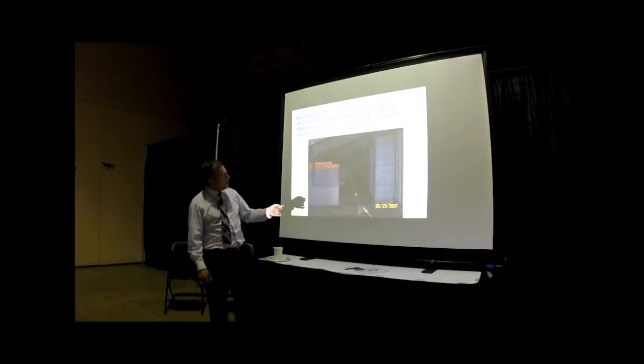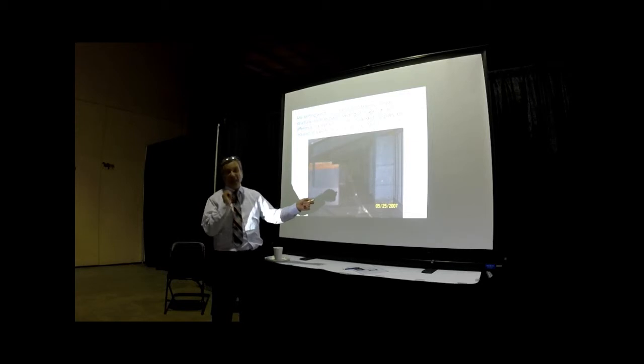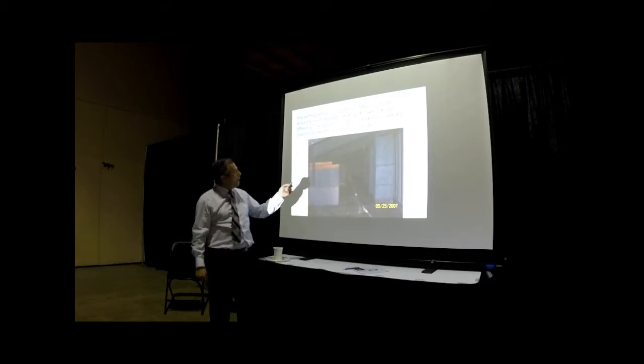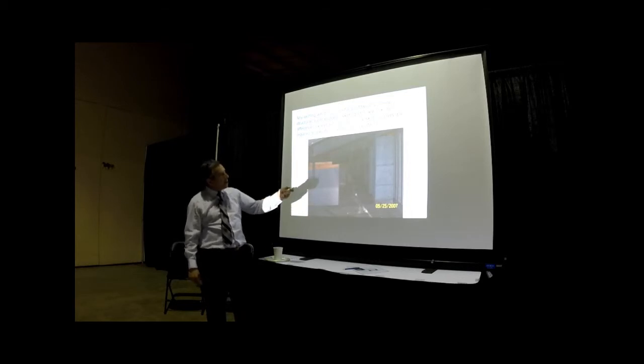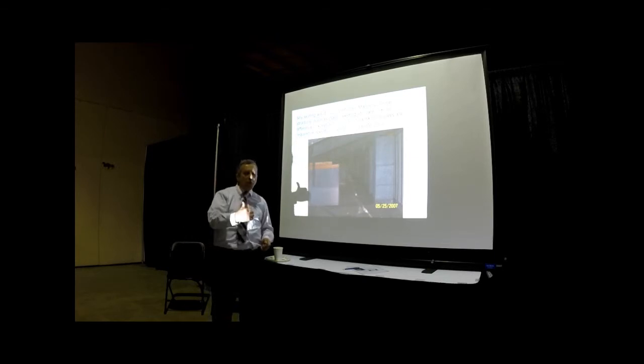Now, look carefully here, if you would, on your right side. Can you see the vinyl? Just beside the vinyl, there is a stack of concrete blocks, usually at 6 foot on center. This is the stack at the very edge of the house, at the very perimeter, that supports the exterior walls that support the roof. See the roof coming on the exterior walls, and you need to have a stack not only under the chassis, as you can see here, but also at 6 foot on center at the very edge of the house to support the wall that supports the roof.